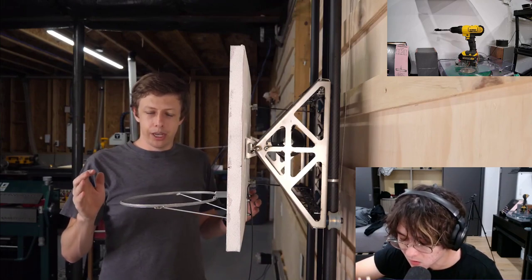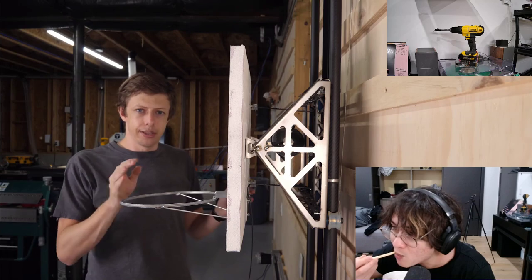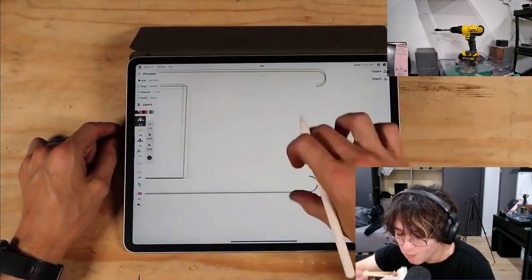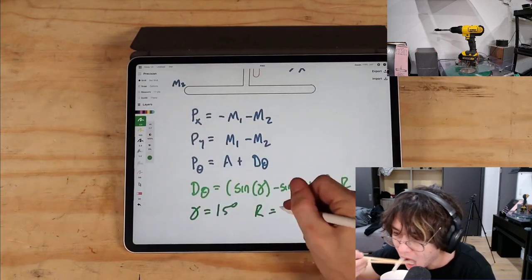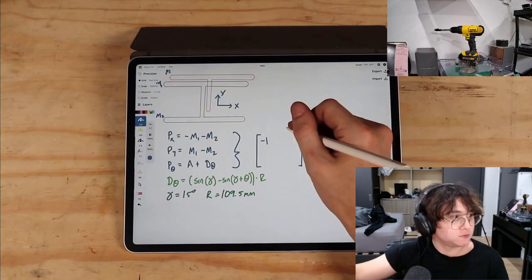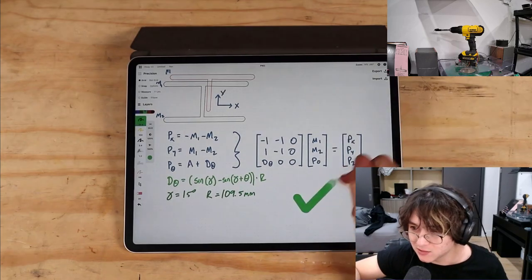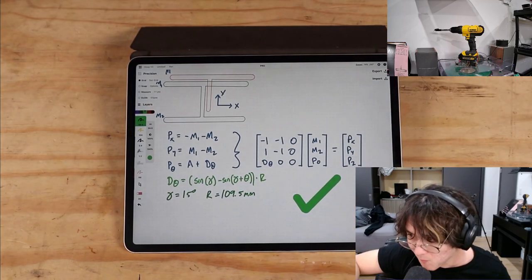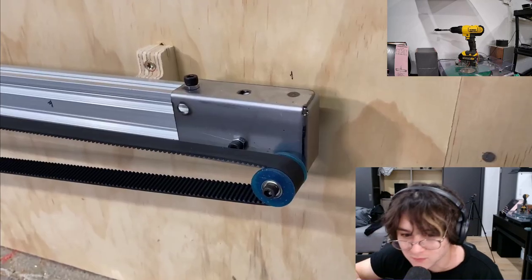Having all three motor positions coupled this way is a bit annoying, but it allows building the system in a very light way. Figuring out how to rotate the motors isn't as bad as you might think — you can write it all out as a pretty simple system of linear equations, then write that as a matrix and solve it directly without any equation manipulation. This is one of the very useful applications of linear algebra.